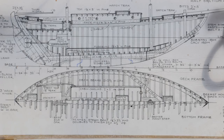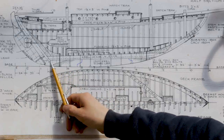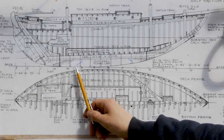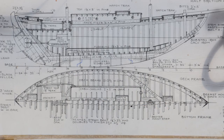If for some reason down the road one of those glue lines were to fail and water got in and this were to rot, there will be bedding compound and paint between the deadwood and the wood keel. So worst case scenario, we could haul the boat and replace the aft or fore piece of deadwood. Although a project and a pain in the butt, it wouldn't be a catastrophic thing to have to do.